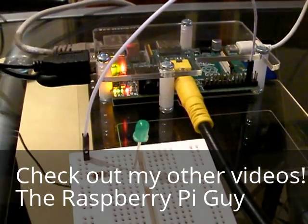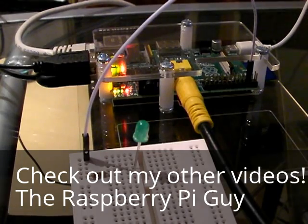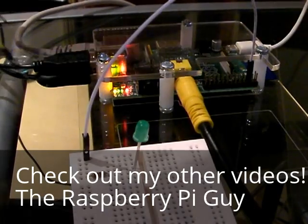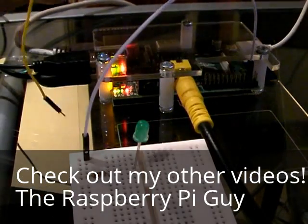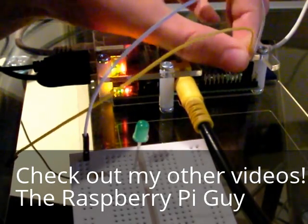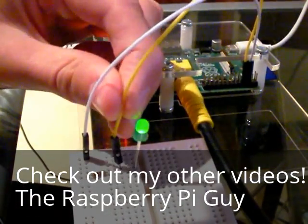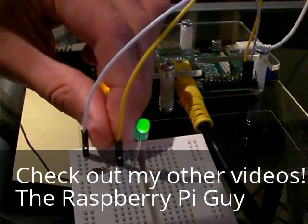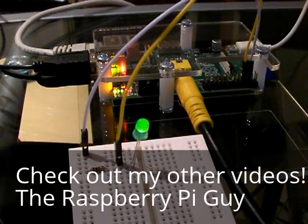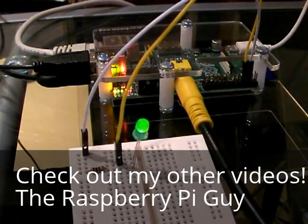Now I find pin 14 on the diagram. That diagram can be found easily just by Googling 'Raspberry Pi GPIO pin layout.' It's just one down from ground, which makes it a lot easier, so we just put it down onto this one — again, making sure you take the greatest care. You might see that your LED lights up. That's because maybe that GPIO pin's on by default, or you've done an earlier program that lit it up and kept it on. Don't worry about that.